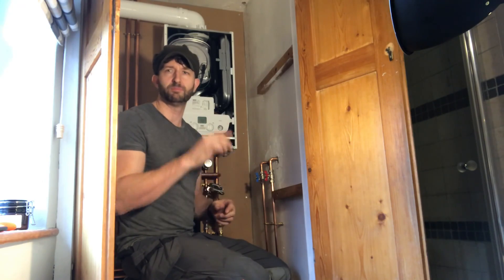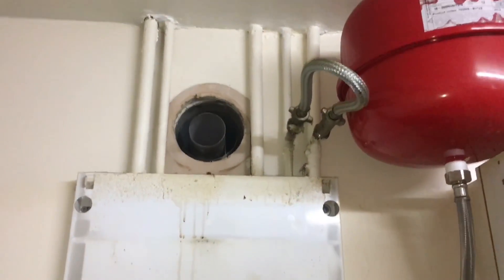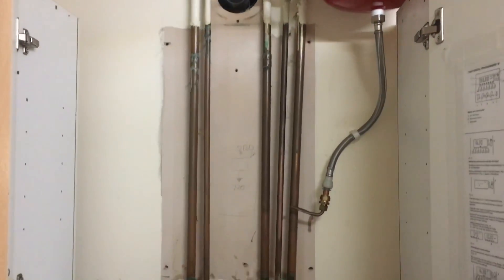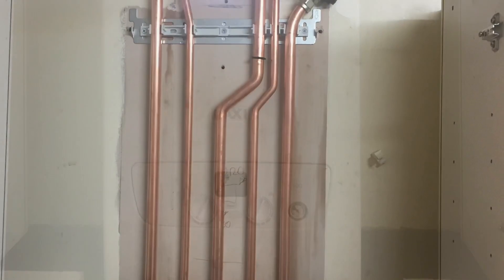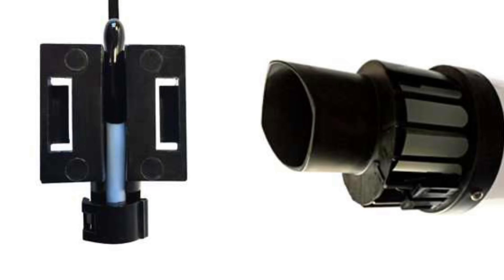So we've looked inside the boiler — I'll let you make your own mind up about it. But to quickly run through some of the points: it's lightweight at 29 kilograms. Cupboard fit, rear pipeable without the need of a standoff kit. You can buy a rear pipe kit with preformed bends. With the Baxi 600 you can order this rear pipe kit — you get the preformed bends and some extra clips — and clip them onto the wall plate without an extra jig to achieve the cupboard fit.